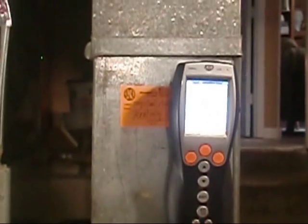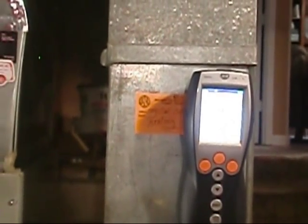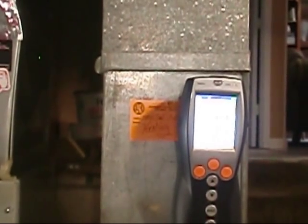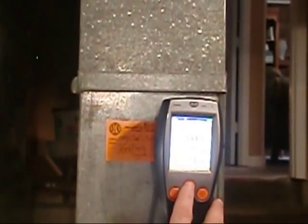And so that would come in. You got high static, but all that's going to cause it to overheat. Right. Static, gas pressure, static airflow, whatever. So it is kind of running high. All right. Now I did change the blower tap on there. I guess I could increase the speed. So we'll sit there. We'll save that.